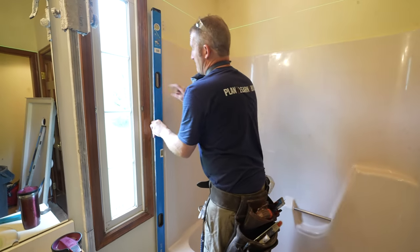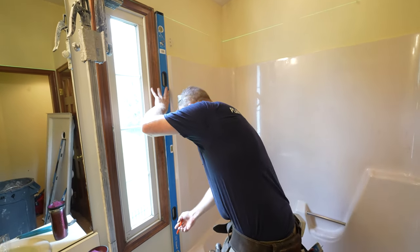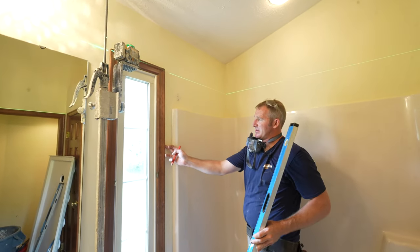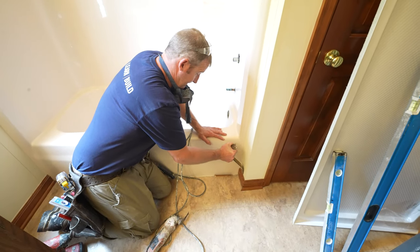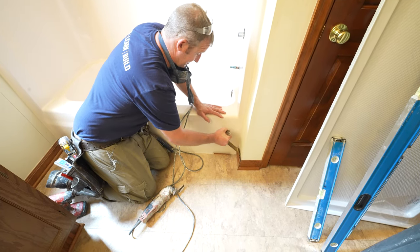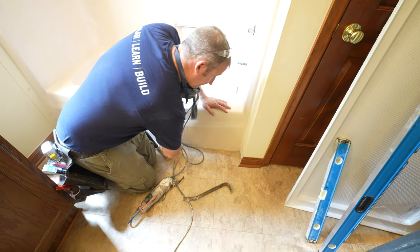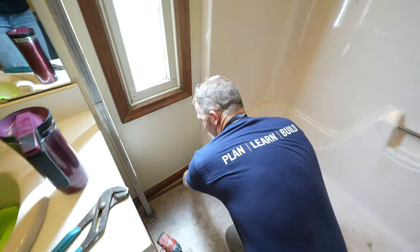We'll do that same thing over here. My tile work will overlap that little bit of drywall there, and it'll be all waterproof. We're going to take this trim off — I'm going to have to re-cut this trim after I get the tile up. So just be delicate with it. If you're trying to save the trim, you don't want to have to match or stain a new piece. So let's set that aside, and same thing on this side. We'll get more accurate once we get the tile layer down.